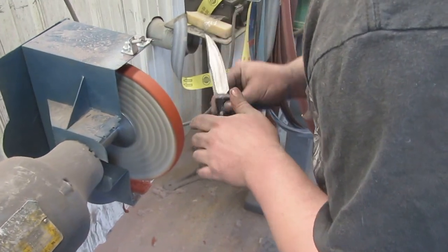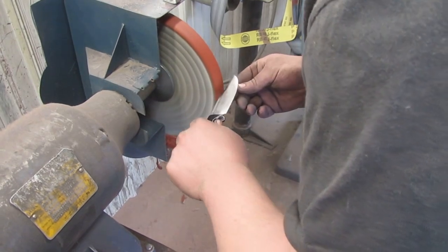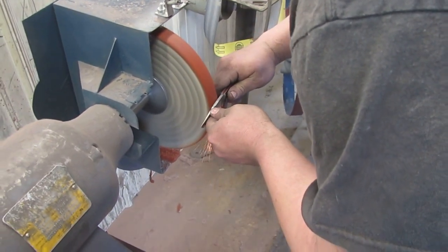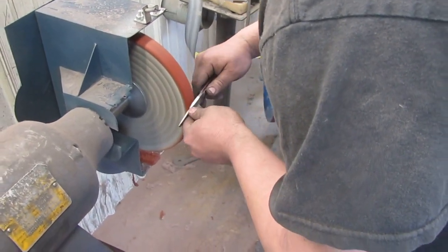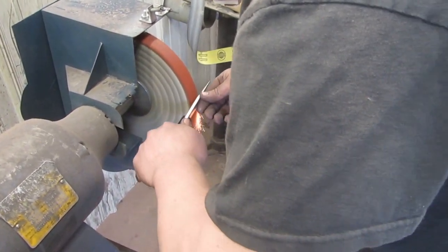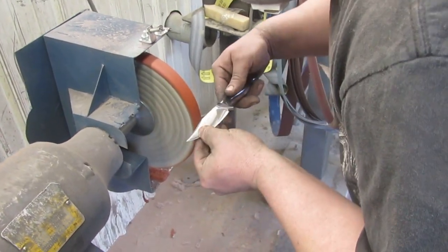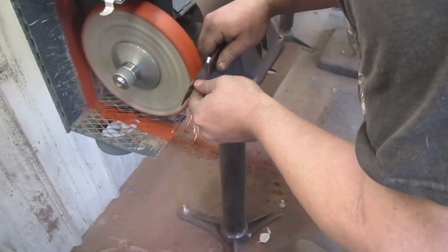Guys, our blade is ground. We've got Josh bringing it home now. Michael ground our primary convex bevel on the sled, ground it super thin. Now we'll put the final finish on it. We're going to put the badge on it. Down to the 240 here. If that would just get out of your way, right?